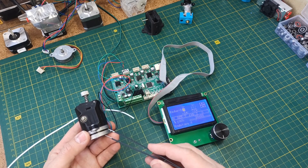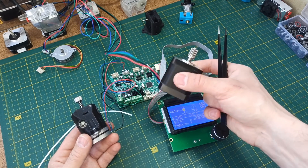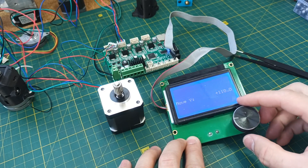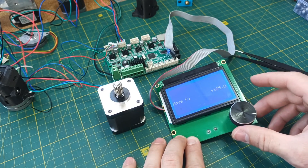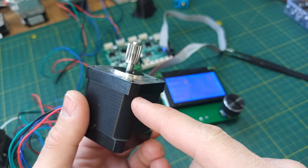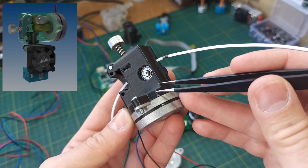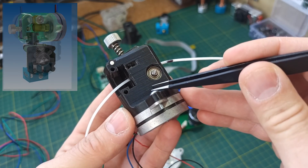Many of you may think the problem is the motor being too weak, but in fact that is not the only issue. For comparison, let's connect a larger 48mm motor and see if it can move the axis 10mm. As you can see, our very powerful 1.5A 48mm motor is also not capable of working at such a high speed. So the problem is not the power of the engine but the speed.